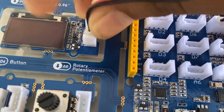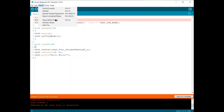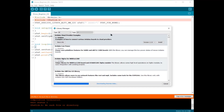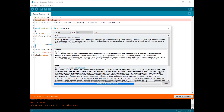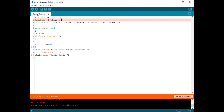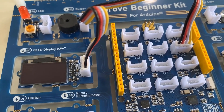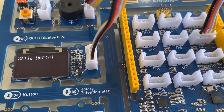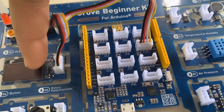The seventh experiment is interfacing the 0.96-inch I2C OLED display to the Seeeduino board. Connect the OLED display to any of the I2C pins. We need a few libraries, so go to the Library Manager and search for U8g2lib — here is a library supported by various boards and modules, so simply install it. We include the library and display 'Hello World' on the OLED display using internal library functions. After uploading the code the OLED display turns on and shows 'Hello World', but you can display anything you like.